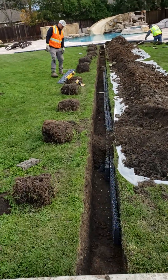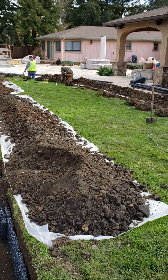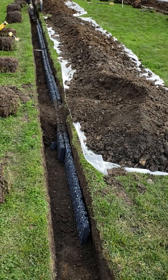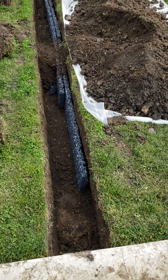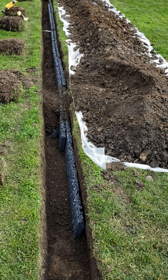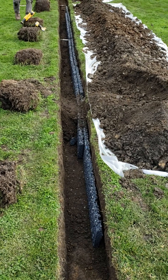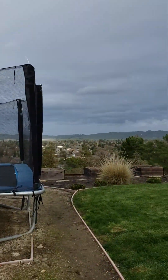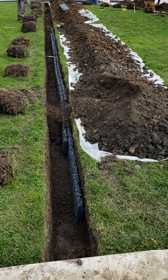In this case, we're doing a two-board run. Extra insurance — is it needed? No. Do I want the extra insurance? Yes, and so does the homeowner. As you can see, we've excavated all this dirt, and unfortunately we're doing it with shovels. We end up digging a trench that's twice as wide as needed because the boards are only two inches wide. For a double run, a four-inch trench is needed. We elected not to use a trencher today because even though it's not raining now, it was raining pretty heavily all night last night, so we figured we'd have a lot of mud. We just hand-dug it.